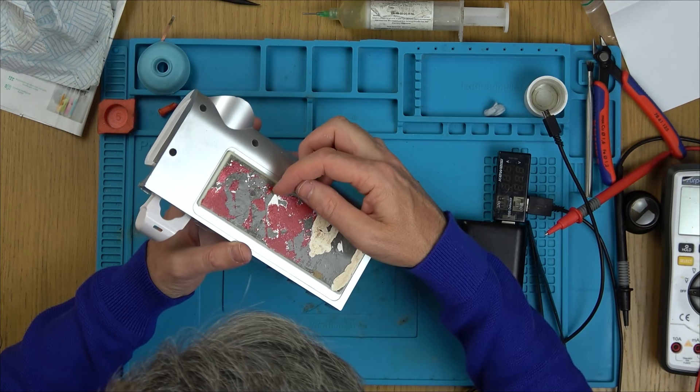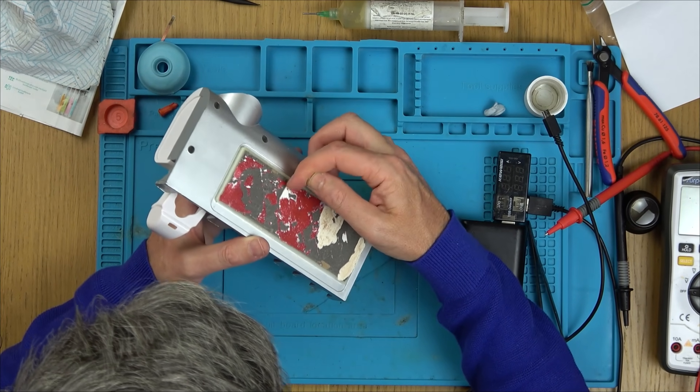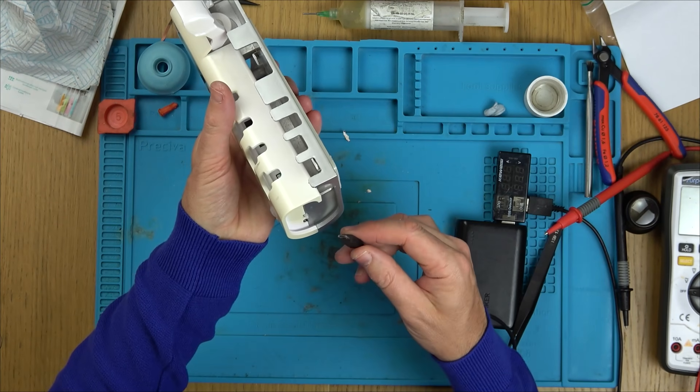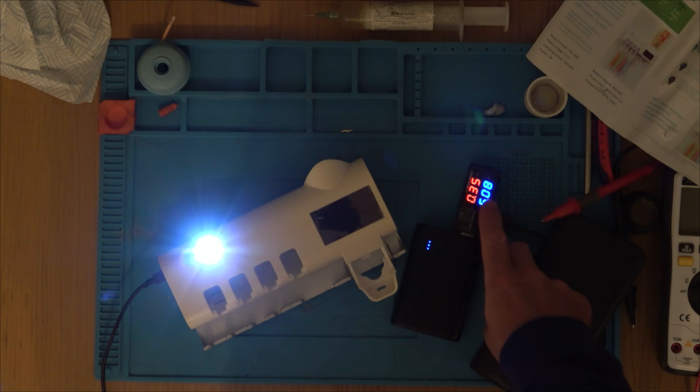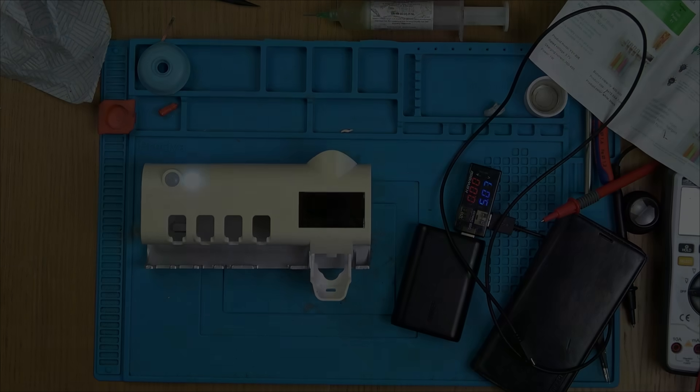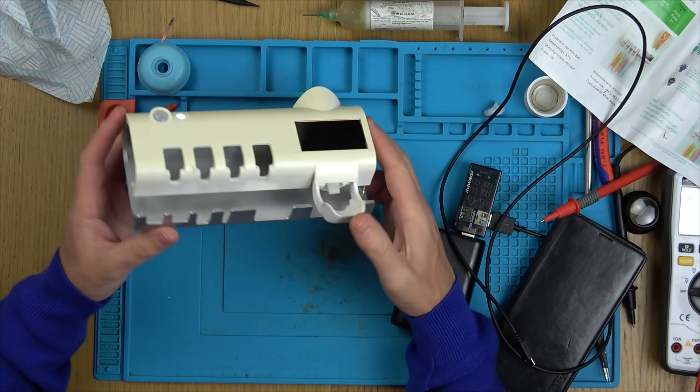Colin's bathroom paint history — original colour looks like it was red, then lilac, then he's gone over to white! Let's leave this plugged in and see if it holds charge. The blue light is on and the charging current has dropped. I'm going to go near the sensor — and there you go, the light comes on when I put my hand over it. The sensor is working, the blue charging light is working, current dropped from 0.7 to 0.3 amps — it's fixed.